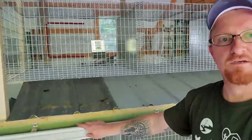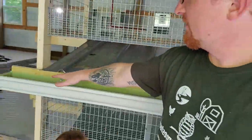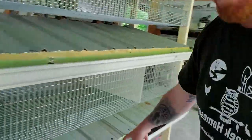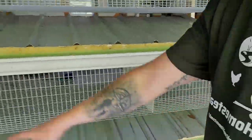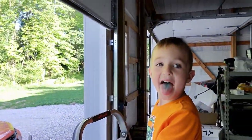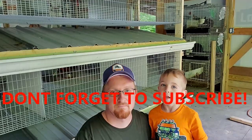Alright, so what I've done here is - as you can see, it's lower on this side than it is on this side. I just put a slope to the gutter so it will naturally drain this way. I'm going to cut a hole right here in the bottom of the gutter and put a downpipe, just like you have on your house, so it drains into a bucket. I'm going to do the same thing on the bottom, except it's going to drain on this side over here. That way I can have a bucket on each side, and each side will always automatically drain. Then I can take a garden hose and spray it off whenever it gets built up to clean it really easily. Alright, thanks for joining us today and please subscribe to our channel, bye.